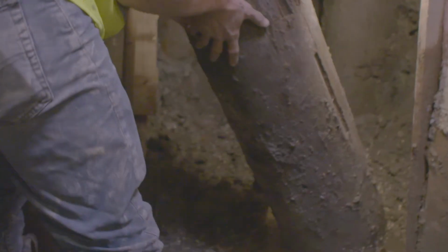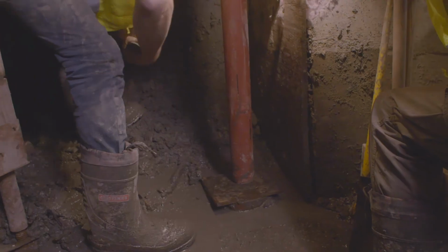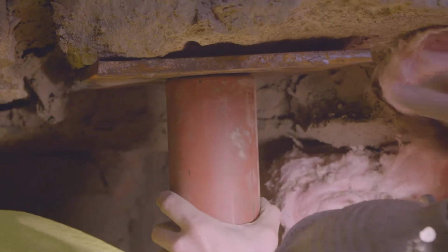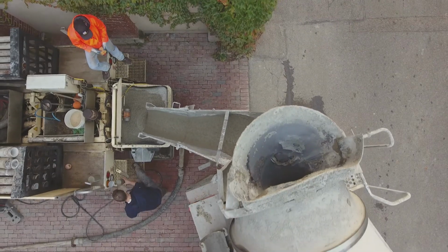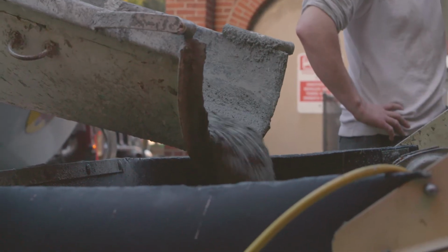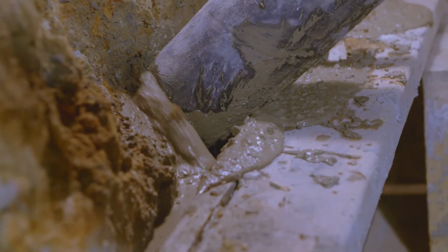Each pile, as you're cutting it one by one, you're replacing that section you removed of wood with a steel post, and it comes back up to the granite block. And so at the end of cutting out a series of 7 or 8 piles, you have a series of these posts. And once you've posted those piles up, what you then do is you usually put a form up and then encase everything in concrete.